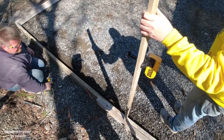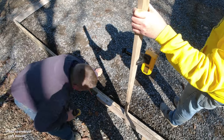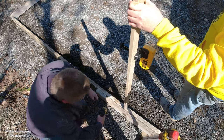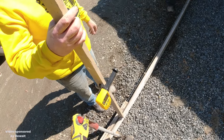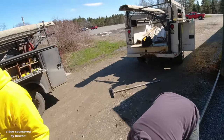It also has an up arrow and a down arrow on it. If you're too low, it tells you to raise it up. If you're too high, it tells you to go down. So that makes setting forms like this with a laser level really easy — really, one guy could do it if he had to. We like doing it with two guys. Just makes it really fast and there's usually two of us anyway when we're setting up forms like this.